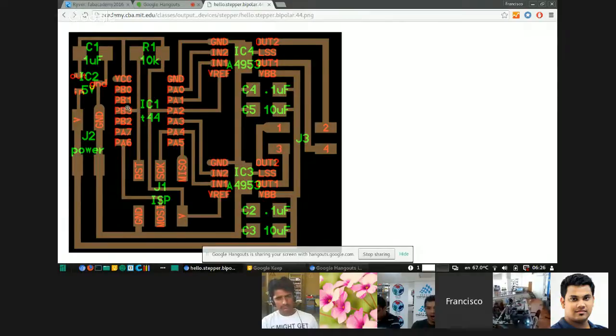Okay, for this board, what we need to do is this: 12 volts are going to come through here, and then on the other side it is converted to 5 volts and goes through the microcontroller, but sharing ground. Ground is shared across the 5 and 12 volts. So for this week, this connector, somehow we need to move this component to this side. So the power must be in here, this side. Wire the exit of the 5 volts here and here. But the other part of the connector, we need to hook it to some pins here, because we need to make a networked board.